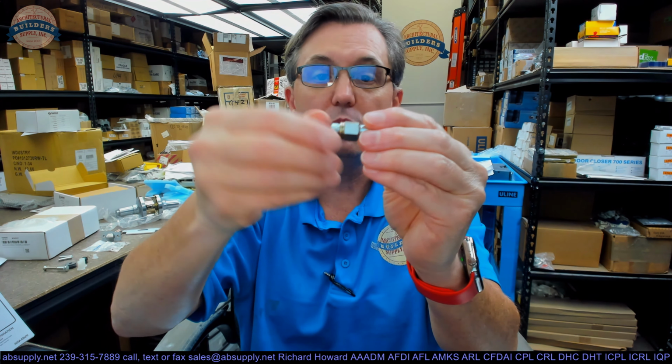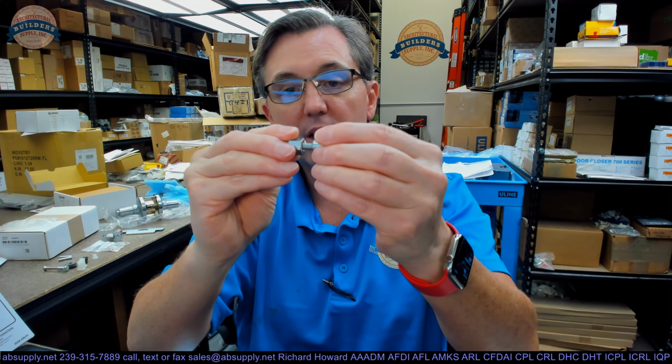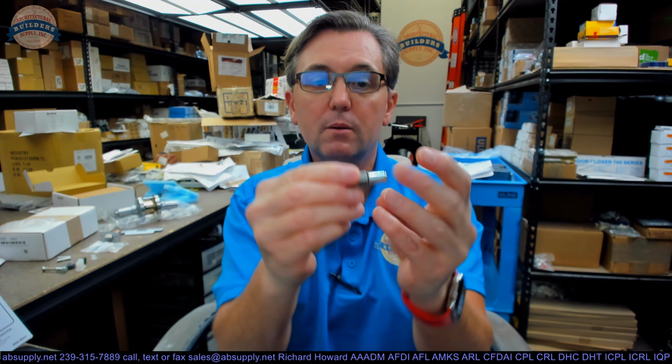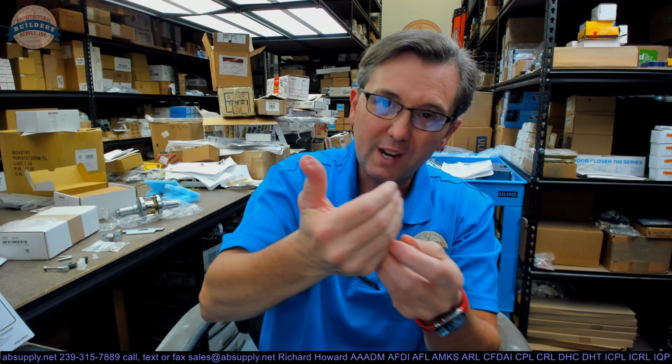Before you get there, though, you're going to have a couple of what would be called blind nuts or riv nuts, or I guess collapsible nuts. You need 2 of them, obviously. One of them is going to come with the tool already installed. What you see here is when I remove the riv nut, this is the tool. You drill the hole, push this in, bring your tool, and then tighten with an Allen wrench, and you'll collapse that riv nut onto the thickness of whatever you're installing it to, your hollow metal frame or your aluminum frame. You keep tightening until it completely collapses. The installation instructions say to be sure you're pushing forward so that it doesn't creep out a little bit. Lots of forward pressure and tighten that down.